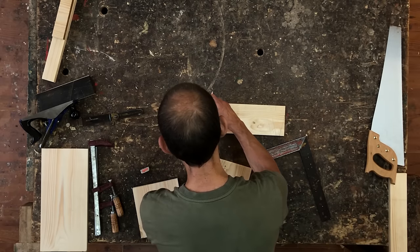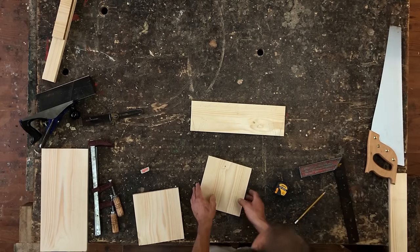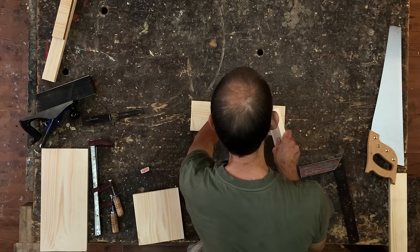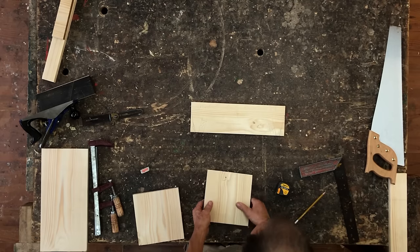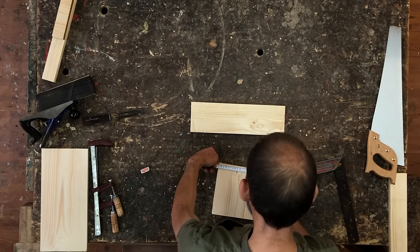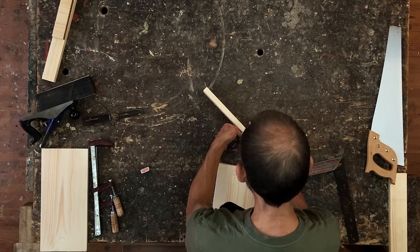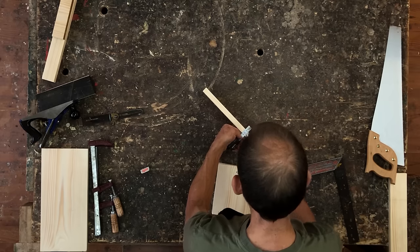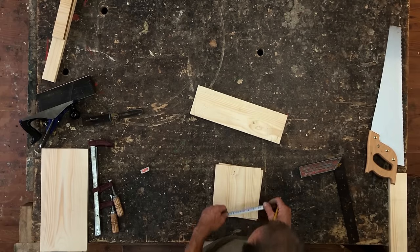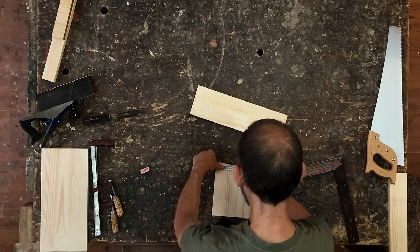Do the same over here. And this is what's going to go. And on the legs, I also need to cut out 5, so then it'll slide up to the top here. My material is exactly 2 centimeters, which is really nice. And this is 19 centimeters. 19 minus 2, 17. Divide this by 2, it's 8.5.